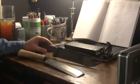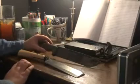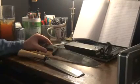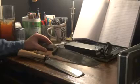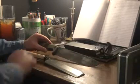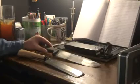On the Junglas, which is a traditional flat ground blade, they typically have full flat primary grinds, which are about 3 to 5 degrees per side. They taper down to an edge, which is usually 40 or 50 thousandths thick, and then they have a secondary edge bevel that's usually around 20 degrees per side. Now, this blade specifically has a secondary edge, the one that's unmodified is the one in the middle, around 45 thousandths thick, and the edge is sharpened at around 20 degrees per side.